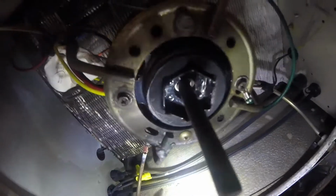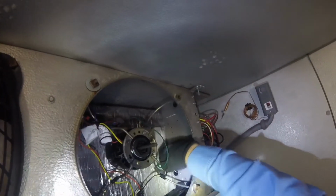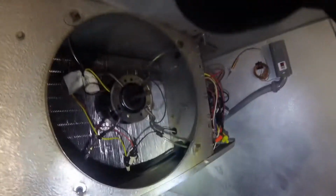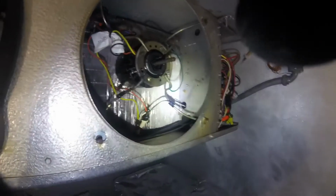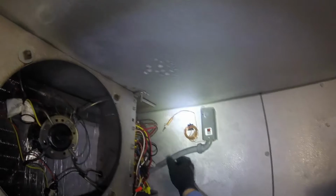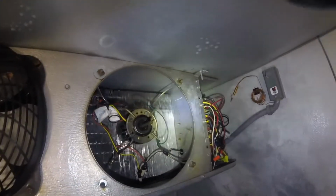That's all it is to it. Alright. So, we got that leg welded up. Looks pretty good. It's not gonna move. We got a half inch knockout in there. Alright. And then we got a thermostat with conduit for the sensing bulb. I'm gonna go ahead and put the fan blade on and mount this on, and we'll see it once it starts back up.